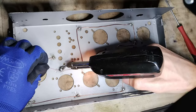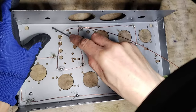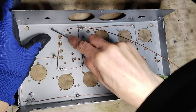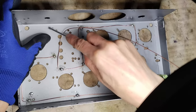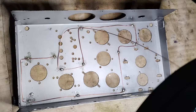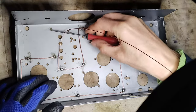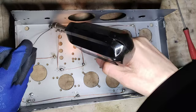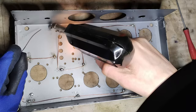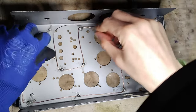With a non-galvanized, thick iron chassis, it is a good idea to prepare more comfortable ground connection options before rebuilding the radio, using some copper wire like in this clip. However, there is one thing to observe. If the surface is iron like in this case, and the soldering points are relatively small, it is not advisable to use the solder alloy containing bismuth, because the solder applied will be rigid and it will come off with any small stress, including vibrations.